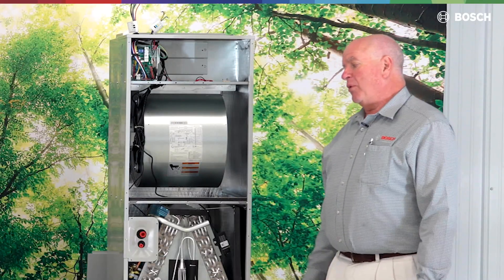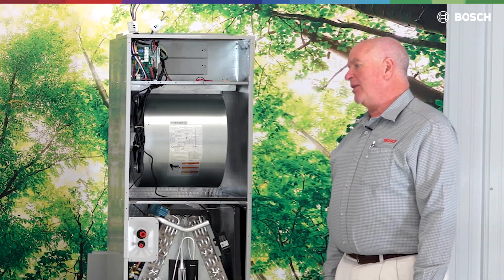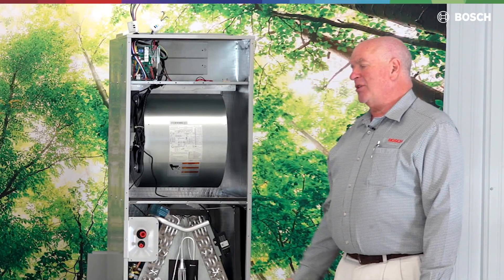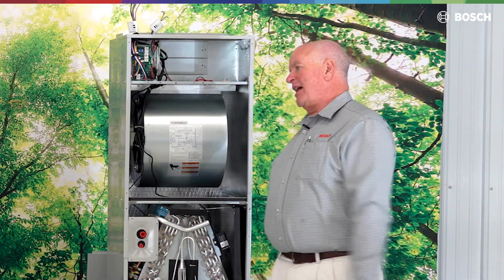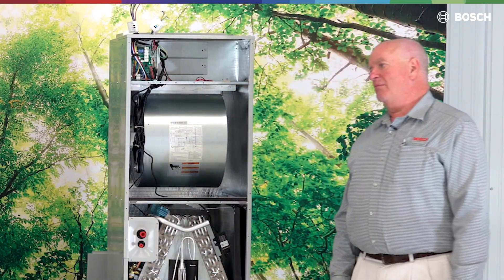In a place where I live, they don't put heat pumps up in the mountains because they form igloos. They have such high snow drifts that they'll actually encase that unit and then it melts out the inside. So location is kind of critical.